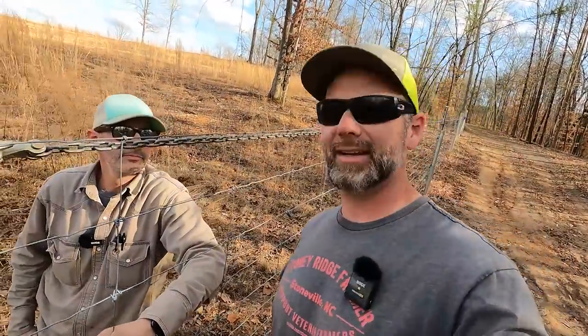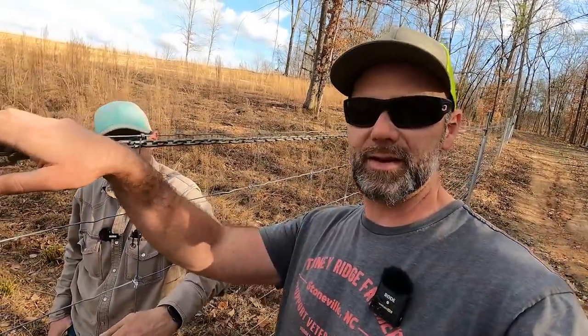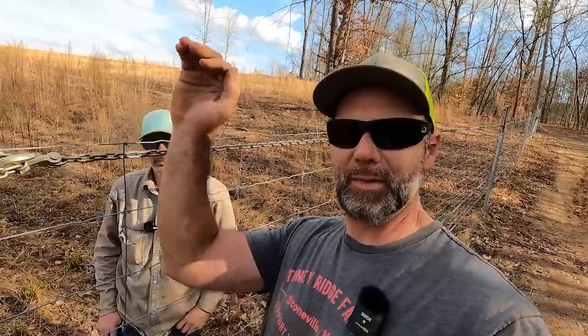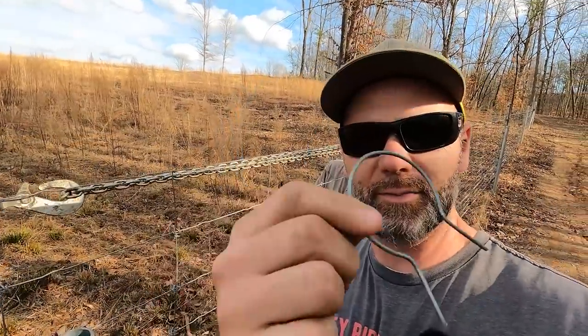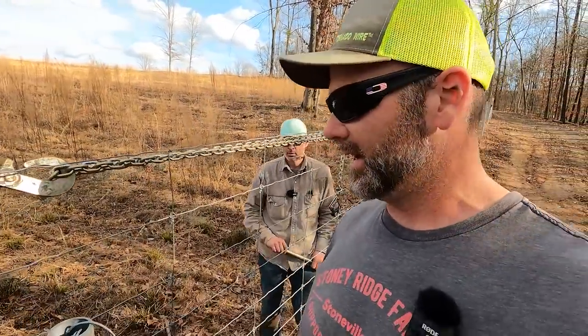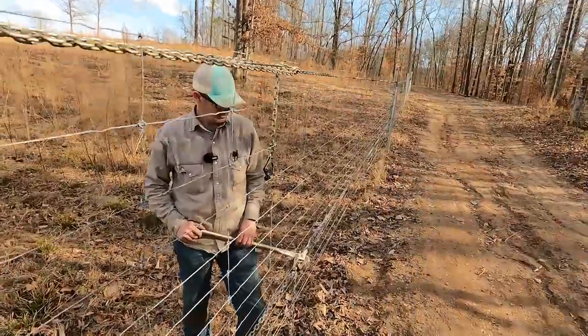All right, Luke. Are we ready? We're ready to take the boundary strainers off. All right, cool. So we'll release these boundary strainers, and this wire may come up just a little bit, and then we're going to go ahead and tie off to our post right here. And these are the wire ties that we use to tie off to the post. So we just clipped some of these off. It's going to be awesome. It's going to be great. Thank goodness we got it fixed.